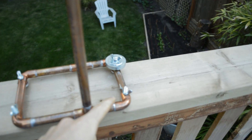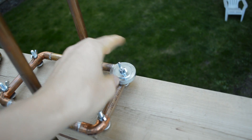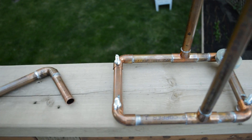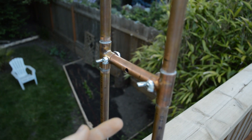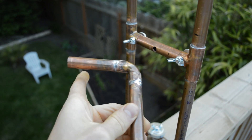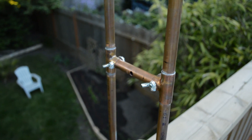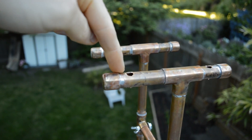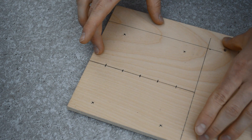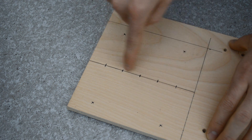I assembled it all together with the bolts in place. I've decided to combine the fastening bolts with the weight-holding bolts to kill two birds with one stone, making the design simpler with less hardware and setup time. Up here I've got the handle mount, also bolted in place. The handle is made of a five-inch piece and a three-inch piece held together with an elbow and capped off at the end, secured with a universal joint and a few bearings. Up top I've got four holes drilled to hold the wooden camera mounting platform. I'm using half-inch plywood, marked out a six-by-six box, and made marks every inch for camera mounting positions.